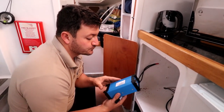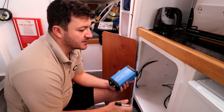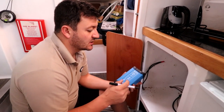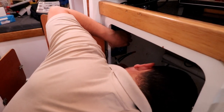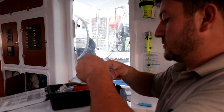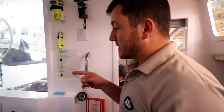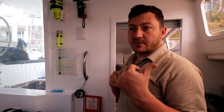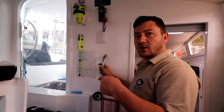So now we're finally installing them after having them for a while. The great side of this is I can crank it up, so I'm probably going to be running our water maker at about 27 to 28 volts, which would be the equivalent of a 24 volt system on fully charged mode. We connect up there on the bus bar, but I haven't got the fuse — I'm only going to get the fuse tomorrow. So we're going to connect up now just to see which one's positive or negative, put the lugs on, heat shrink them, plug it in, and then we'll probably test it today and add the fuse tomorrow.